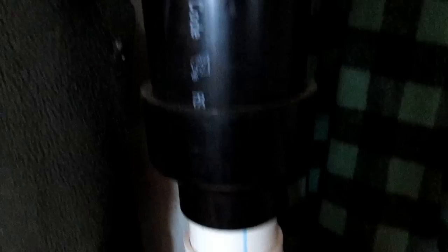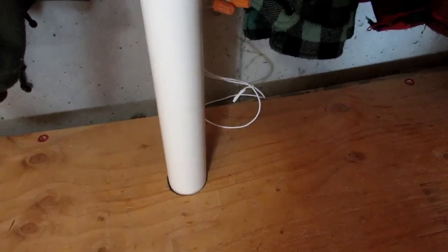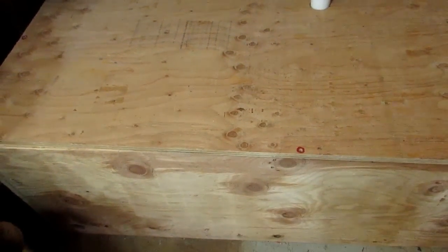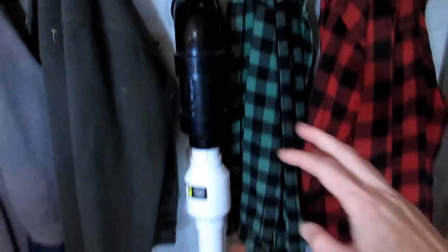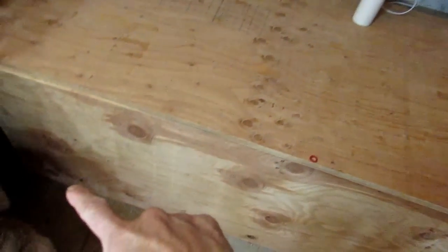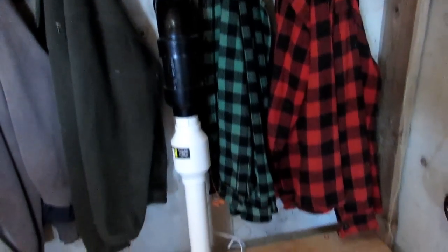When these batteries are charging up, they release hydrogen gas — and we can smell it. When we first designed our shelf battery bank, we did not have a button fan. All we did was use a fresh air vent. What we found was the gas was still building up in our shop area — really, really dangerous. A friend came over and smelled it. We showed him our vent hole that goes to the outside, and he said you have to have more than just a vent hole. So when you are designing your battery box, you're going to have to think about vent holes and buy yourself a button fan to draw out that hydrogen gas, because hydrogen gas is very, very dangerous.